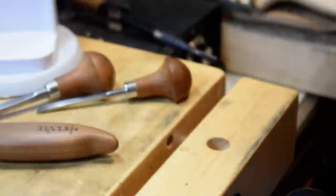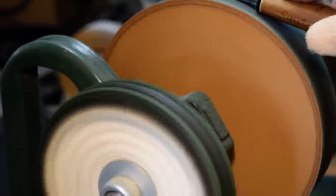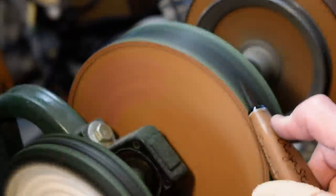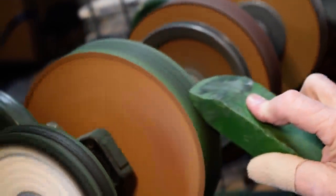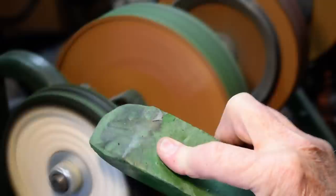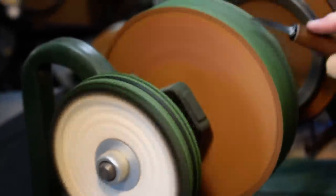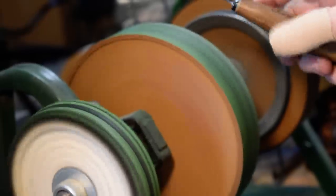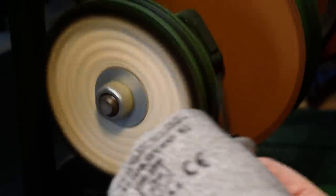Now I want to get back to my knives and show you — this is my little upsweep knife. I'll put it on my leather wheel. The wheel is rotating away from me. I'm going to show you how I apply this green compound — I'll put it on the wheel, press down, and it adheres to my wheel. Do the same to the cloth buffing wheel. I do all my tools this way.